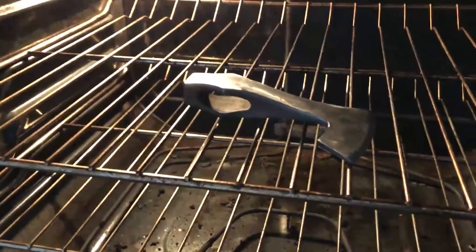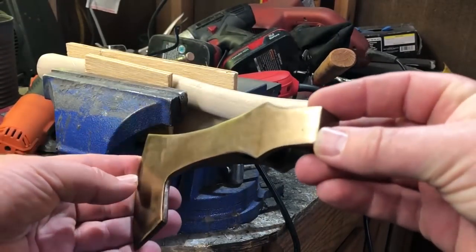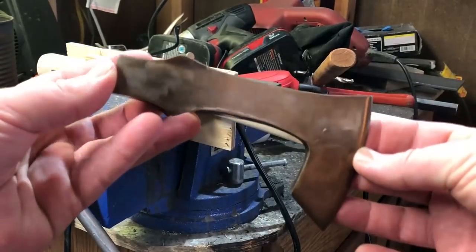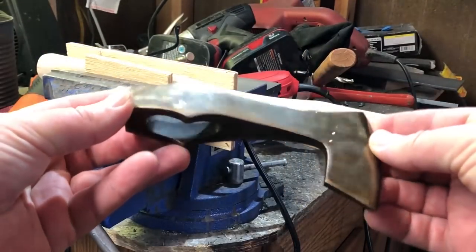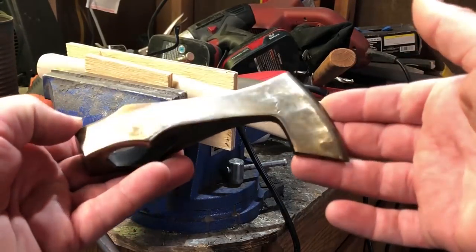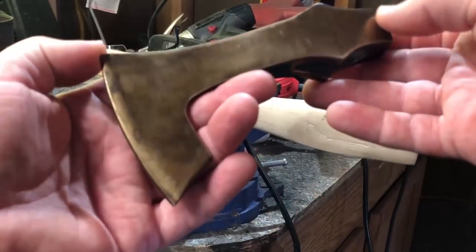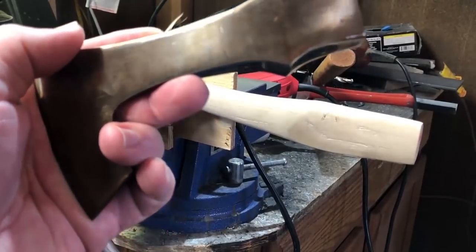Now, this actually worked out pretty well. I like the color of it. That oxidation color gave it a really kind of polished bronze look. But I will say that my knowledge of metallurgy is pretty limited. It's possible that with this type of steel, and again, I'm not sure what it is, although I'm pretty sure it's a stainless steel, maybe 500 degrees is a little on the warm side, and I really know very little about heat treating stainless steel. So if one of you has any recommendations or any comments about that, definitely comment below. What do you know about heat treating stainless steel?